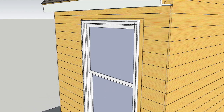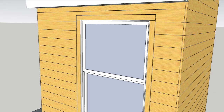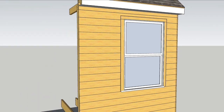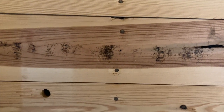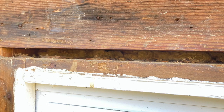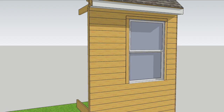Next, I'll remove the brick molding around the windows, which I've already replaced with tilt-ins from the inside. The 1x3s that surround the window opening are painted along the edge because they acted as the exterior stops. You can see that the old-fashioned 1x6 tongue and groove boards are not much of an air barrier, with gaps between every board, holes in many, and a pretty clear pathway for air to whip through around the windows.